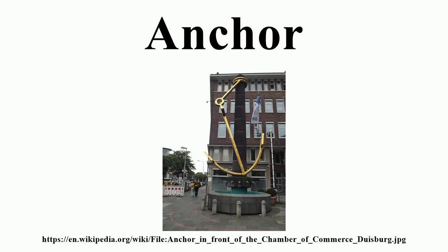Handling and storage of these anchors requires special equipment and procedures. Once the anchor is hauled up to the hawse pipe, the ring end is hoisted up to the end of a timber projecting from the bow, known as the cat head. The crown of the anchor is then hauled up with a heavy tackle until one fluke can be hooked over the rail. This is known as catting and fishing the anchor. Before dropping the anchor, the fishing process is reversed and the anchor is dropped from the end of the cat head.